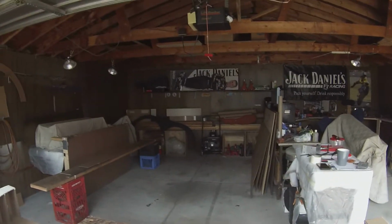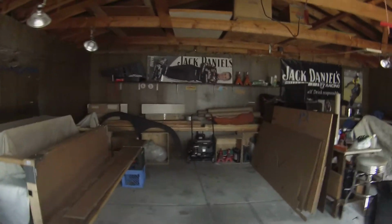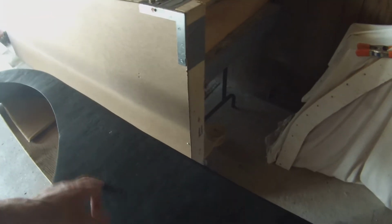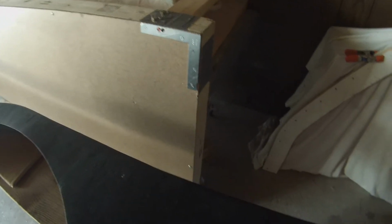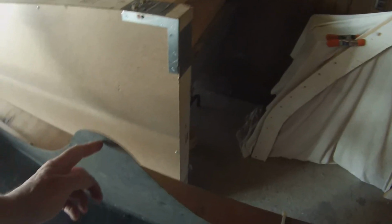And we're actually going to go ahead and add a strengthening rib to the inside here between the wheels to keep that piece from flexing the way it does. I mean, you can see it moving right now. And this is not easy to do with one hand, but it's pretty flexible, you see. And it does that going down the highway. It really gets going. So we'll put something in here, a little piece of something, and glass it in so it's good and stiff and it doesn't move. And that won't have any issue to do with the tires or anything.